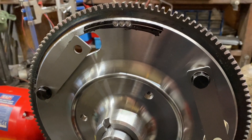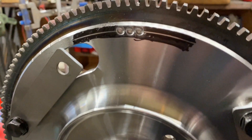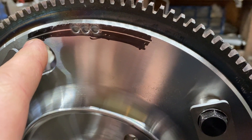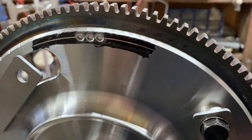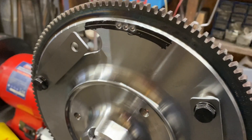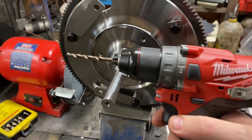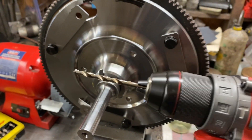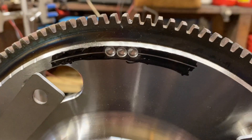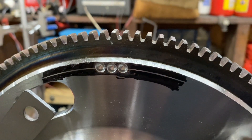The idea now is to drill out metal until that flywheel will stop in any position. For drilling purposes, I used to set these up in my pillar drill, but actually I found it was quicker to just mark the area I needed to drill, scribe a center line for the drill holes with a divider, and then simply use a cordless drill — here I use my Milwaukee M12 Fuel. I'm using a 5mm bit, which allows me to drill holes quickly, simply, and accurately enough for what I need. Then I can drill a series of holes to get the weight out as needed. Start off with the center point at the chalk mark, and then drill out either side of that until we're in balance.